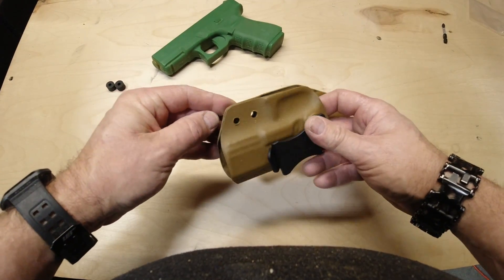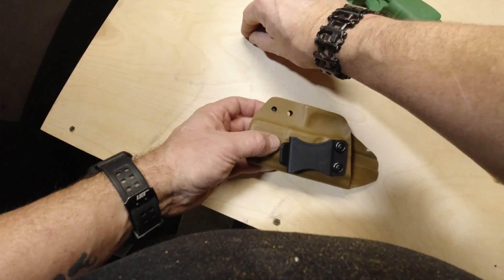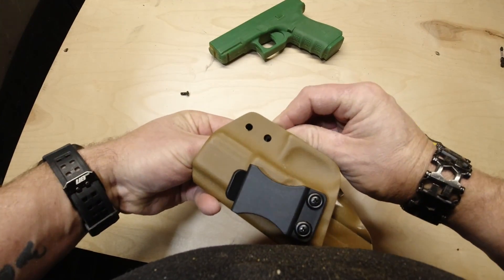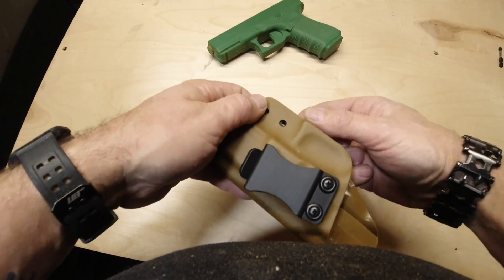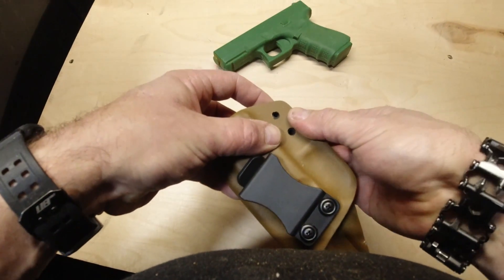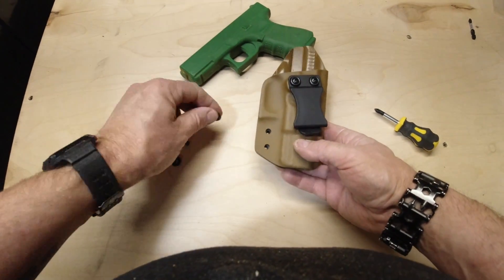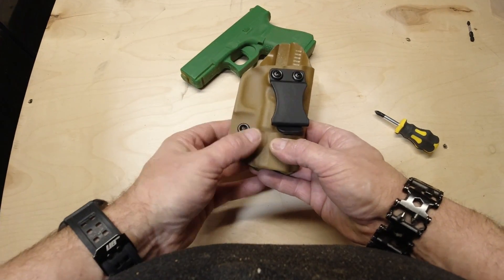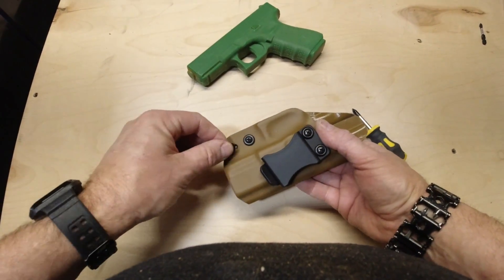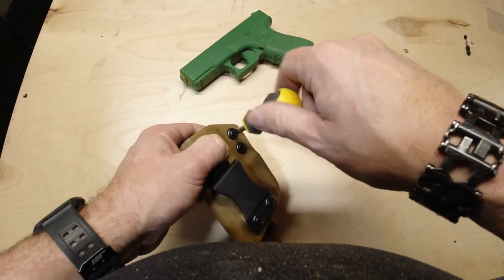Then we'll do the same thing mounting our EPDM washers. What we like about those washers is you get adjustable retention — you set the retention before it goes out, but if you're making this for sale, it does allow your customer to adjust retention a little bit on their own. Once you get all your fit and everything set up, I recommend using Vibratite — the VTC3. We sell it in packets, so if you're sending these out to a customer you could send a packet with them. Let them get their retention like they want, then they put a little bit of that on there and it will hold it from backing out, because over time the screws will just back out of the post. Vibratite is the brand we carry — it's not like super Loctite, so you're able to loosen it again with a screwdriver, but it just won't back out from vibration.